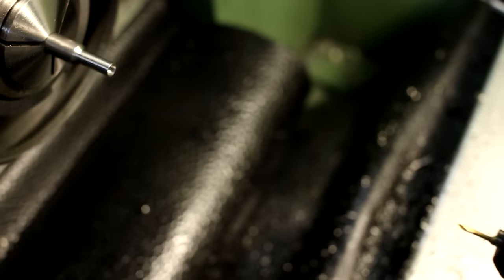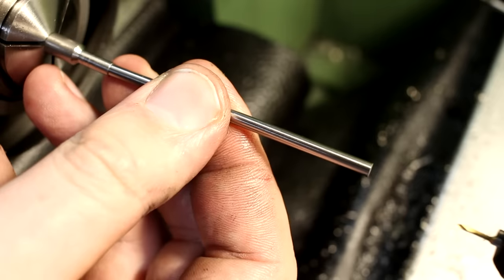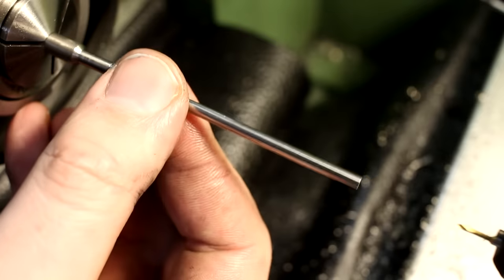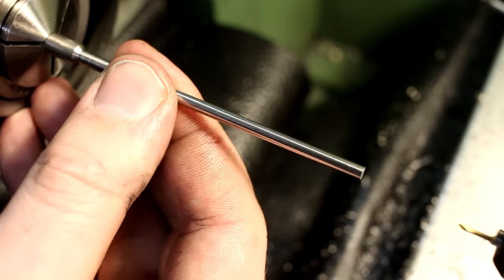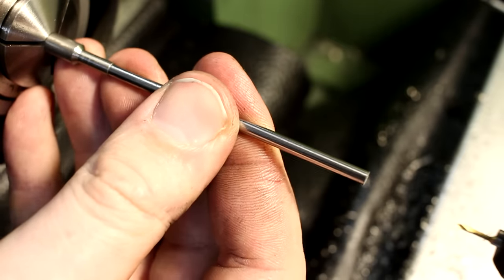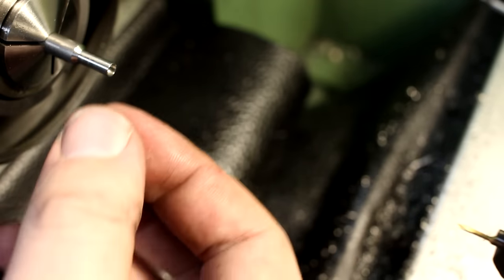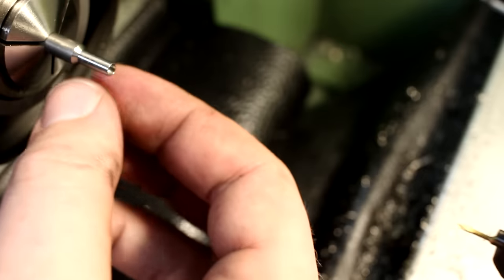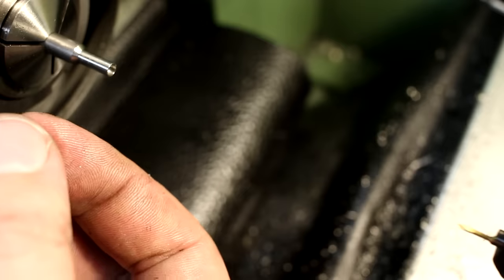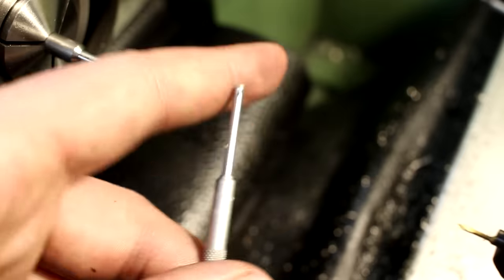So here is a 3.25 millimeter gauge pin, and this very, very barely goes in. A 3.2 goes in nicely. Goes in very sloppy, in fact. And a 3.3, which is the largest dimension allowed, doesn't even start in the hole. That way you can judge a hole diameter very precisely, even if your gauge pin set is only in 50 micron increments. You can also use these guys,